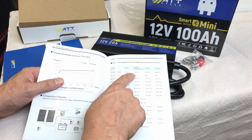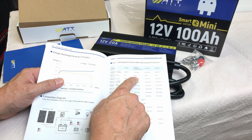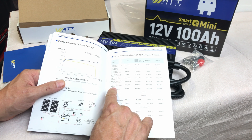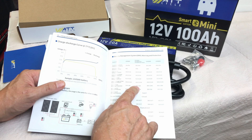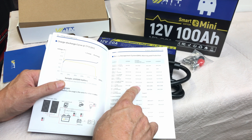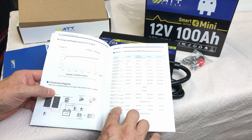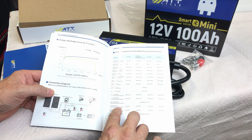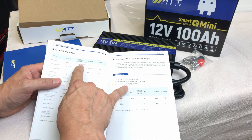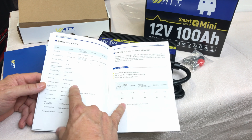Standard maximum 20 to 100 amps for continuous charging, 100 amp continuous discharge, overcurrent discharge protection at 300 amps plus or minus 50 — so 250 to 350 amps — and short circuit current protection. It also has low temperature protection. Weight is 20.94 pounds, just under 21 pounds. Shipped at 50% charge.